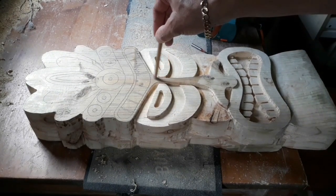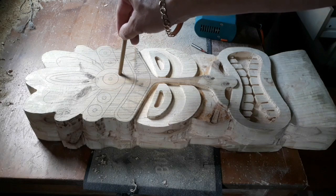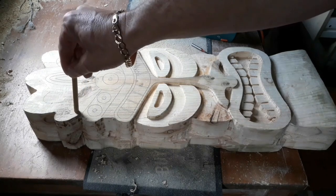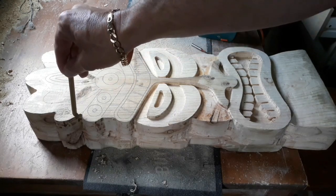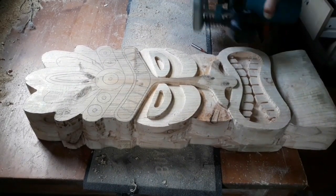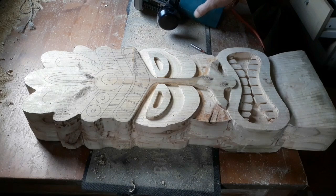This is going to be the height, the nose, and all that band around there. So that middle piece to come out, that'll be the eye's point there. And that bit there stays, and the circles are the lower bits. But I'm going to start at the thickest or the furthest away feather, and then build up and come up to the top, because you're going to need this surface to actually run your router on. I've only got quite a small base on mine, very small plate. And you'll find if it's not level, you're going to start tipping all over the place.